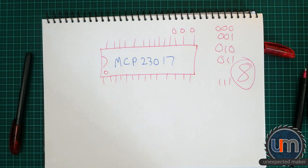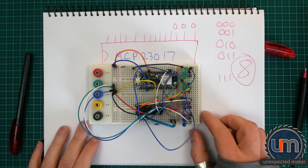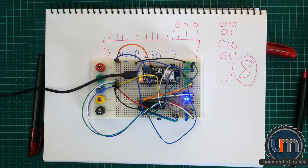Lucky enough, I already had one of these chips. I bought one from Adafruit last year for a project that never got off the ground. I've got an 8-port one and a 16. So this is the 16, all wired up, fancy schmancy. And if I plug power in, I'm controlling a whole bunch of segments — I've got 14 different LEDs that I'm flashing, just doing them in order. The reason I've got 14 is we've got 13 segments, and I'm thinking of sticking an LED on there — just an individual LED for a decimal point.